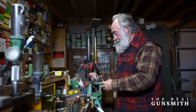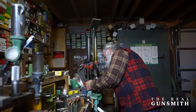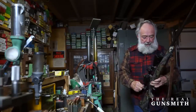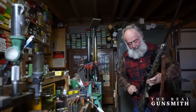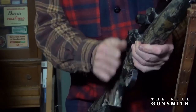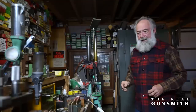Now with another case, we're going to size it. When you go down with your press handle you can feel that case bump the shoulder in the chamber. Repeating this process again, carefully feeding it in — just a little bit of feel, not hard, but just a little bit of feel. That avoids considerable problems — a completely separate case stuck in your chamber means you've got to come have it removed.